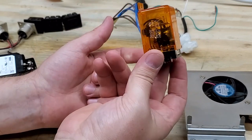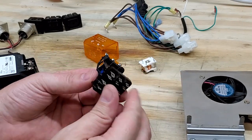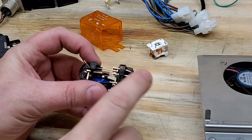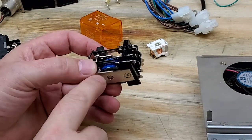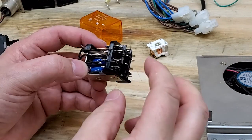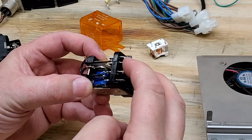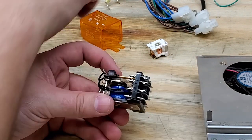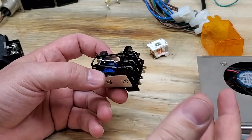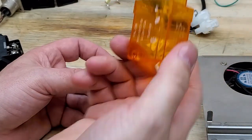Now this type of relay right here is how we normally find them. You find these all the time with X-ray and some larger industrial electronics. You can see that these ones here are the normally closed contacts because you can see how the contacts are always sitting on these two at the top. When you energize the coil down at the bottom — these two pins go to the coil — it attracts this metal plate and it closes the contacts. So these ones here are the normally open contacts — the second one down. And you can check that with a multimeter or you can just look through the clear plastic.